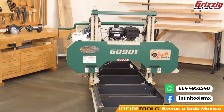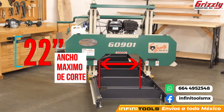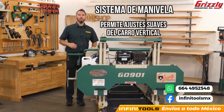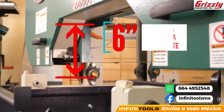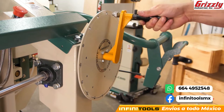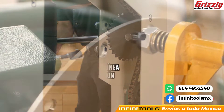The G0901 features a 28 inch maximum log diameter, with a 22 inch maximum width of cut. And when it comes to the depth of cut, or material thickness, you can quickly and easily hand crank the locking height assembly for rips up to 6 inches thick. This handy crank system allows for smooth vertical carriage adjustments in 1/16 inch increments, keeping the carriage even across the width, thanks to the inline chain and pulley system.